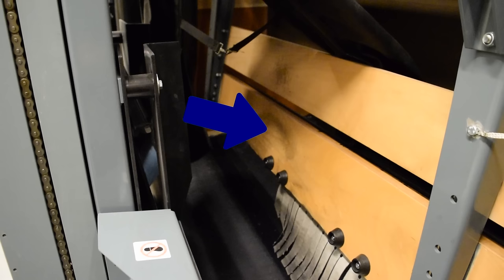Before we get carried away, we will be talking about seven main components of pin setter operation. Number one: the ball pit area. Starting here, you'll see a ball cushion assembly — this assembly absorbs the impact of the thrown bowling ball. The pins that have been knocked over find their way to the transport band, which is a large band moving on two rollers that pulls the pins backwards to the elevator.